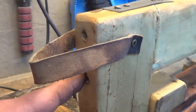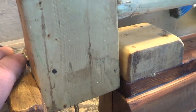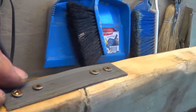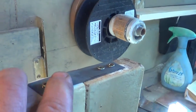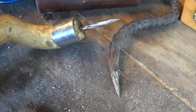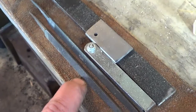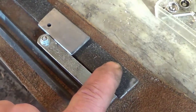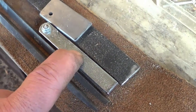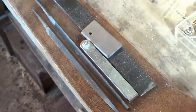So I put this kind of joint in with pocket screws going in, glued it, but it still wasn't strong enough for when you tighten down this threaded rod. So I put in a couple of straps on this side and on this side as well — that should make it strong enough. I put my leather handle back on for carrying it. I have my leather working tools here, and what I'm going to do is make a very simple rustic-style leather pouch for my cross-cut tools. I have a straight edge, a kerf gauge that I made, a leaf feeler gauge, and two tapered triangular files. I still need to make a raker gauge yet — just got to find the right material.